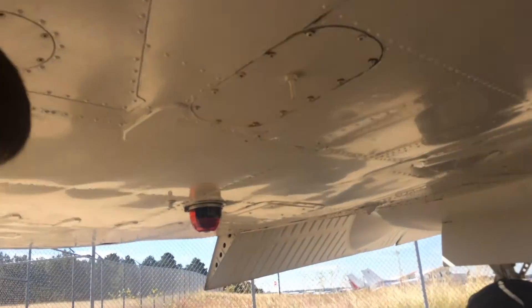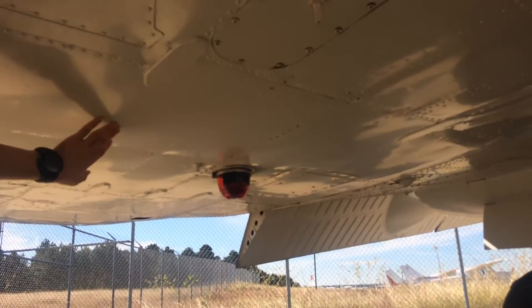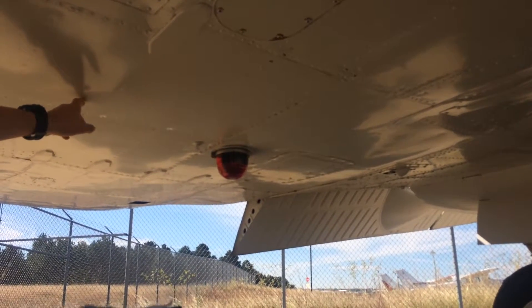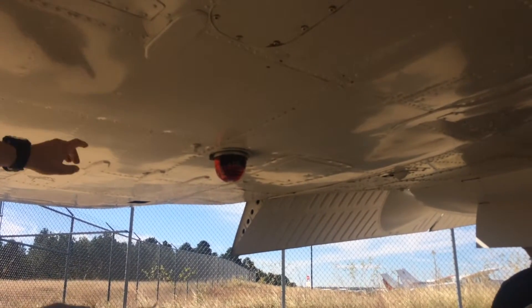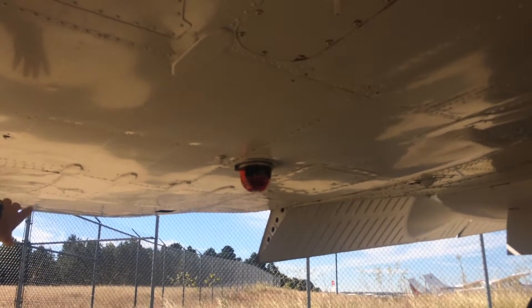If you go under the wing, a line goes from there to approximately right here, where the rotating beacon is, and right there you have your vacuum ejector valve, the distributor valve, and the flow regulator valve all in one component, pretty much together. From there, all the pressurized or vacuum air goes straight to all the boots.